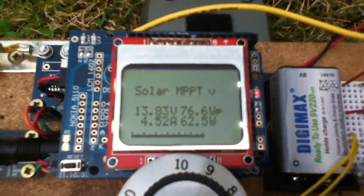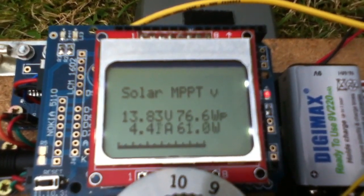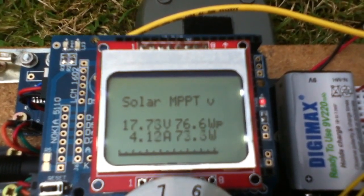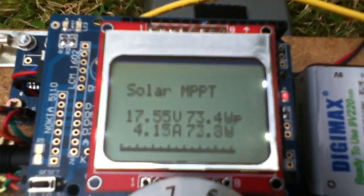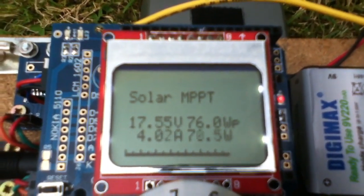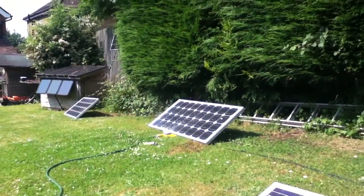For my finale today: with a direct connection I'm getting about 61-62 watts. But if I lower the PWM, I can actually get about 72-73 watts out of that 80 watt panel - and the sun is no stronger. I've made one change: I've put the garden sprinkler in front of the panel, so it's sprinkling water all over the panel, keeping it cool.